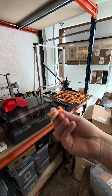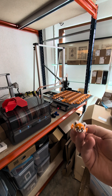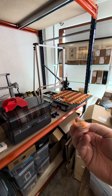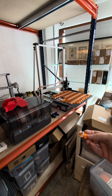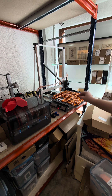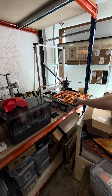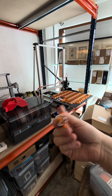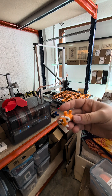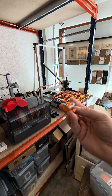The recommended layer height should be 0.2mm, and I've done it with 0.2 as well, same with the axolotl. For the Kobra Max, the print profiles available in the Anycubic slicer only go up to the standard profile at 0.2 millimeters. The quality is pretty good — makes sense given the print time.